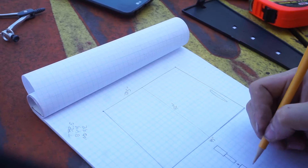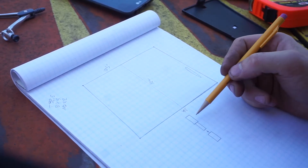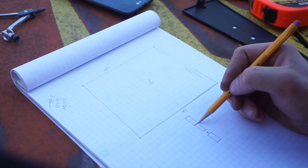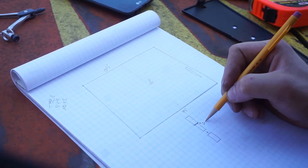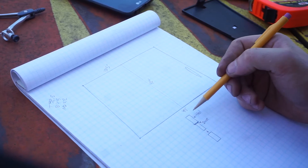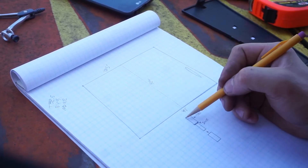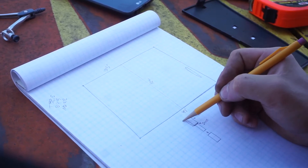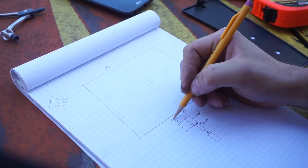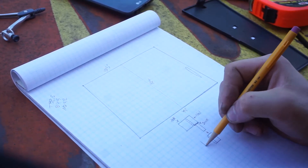Essentially you have a barrel shape, and it fits into just an empty cylinder — it drops in there. You have your lubricant in there, and that way it would just drop in and pivot. Some I've seen have a brass bushing. This would just be steel. These just come as the top portion and the bottom portion so you can weld stuff onto it. So you'd have your steel stock here on both sides — that's my weld because I'm not that great at welding.